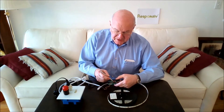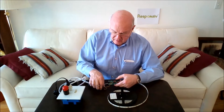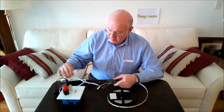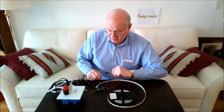Our adapter has, at its heart, a small microprocessor — it's an Atmel Model AT-Tiny85 microprocessor. We've used a circuit from our commercially available LED strip dimming adapter. To that circuit, we've just added a couple of components: an infrared optical isolator and a resistor, with a cord to connect that to the AC line. On the microprocessor, one of the pins is used to sense the power signal, and by connecting these extra components, in addition to sensing the DC power supply level like it normally does, it'll also be able to evaluate the signal from the AC line.